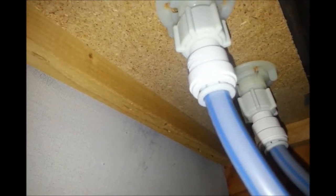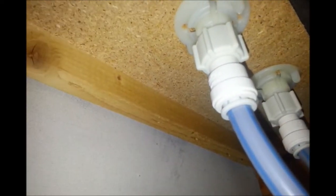Looking underneath the sink to remove it — it's pretty simple. There's four wing nuts and we're just going to unscrew them all from all the sides. Then if you look down here where the faucet is, it's just some plastic plumbing fixtures that we unscrew and pull right out of place.